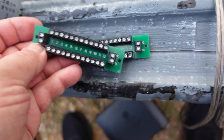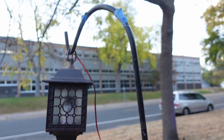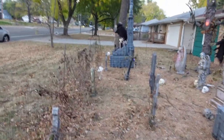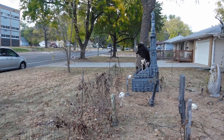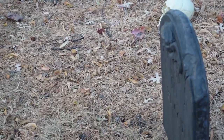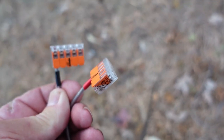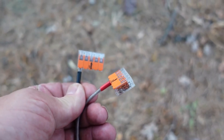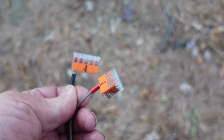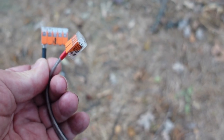I was able to drill a hole with a sacrificial auger bit and get these in. I've got one on the other side down there — both are in solid enough so they're not going anywhere and can just get power run to them. The wagos only give me four extras that I can branch from, but of course I can daisy chain them — take one, get three plus a daisy chain, and get a total of seven. It's a bit of a kludge but it'll work for now.